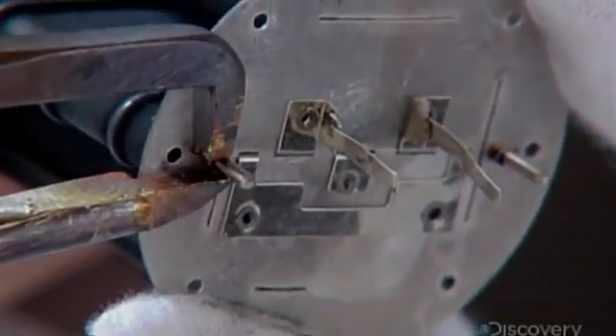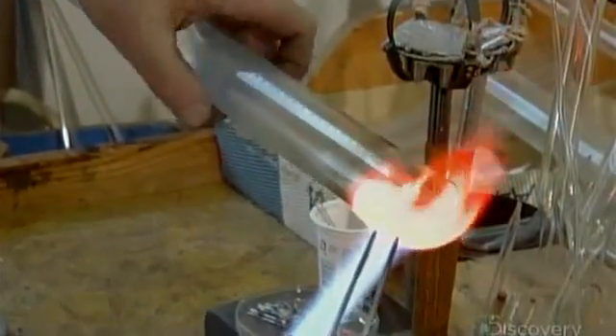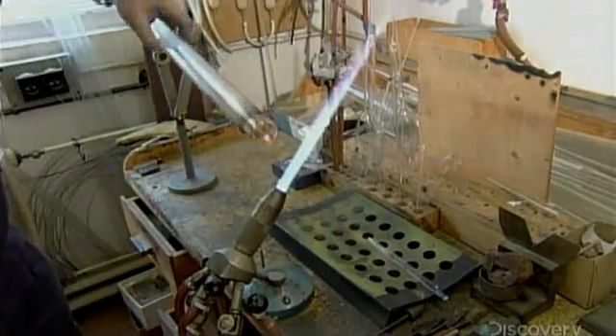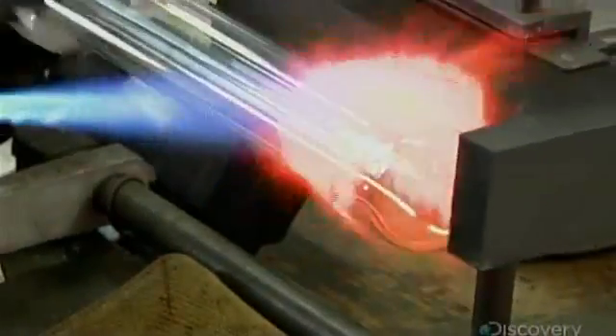With those three key components now assembled into one unit, the inside structure of the tube is complete. Now for the bulb, which will encase that unit. A glass blower skillfully crafts it out of hard, laboratory-grade glass. Using a high-temperature torch and glass-making tools, he melts the open end and seals it off. Then he blows in a bit of air to shape the end into an evenly rounded dome. Now he mounts the bulb on a lathe to complete the shaping, keeping the glass evenly heated.